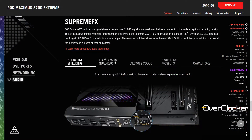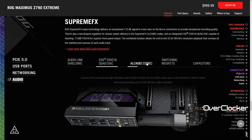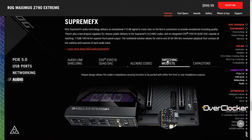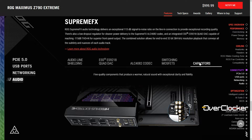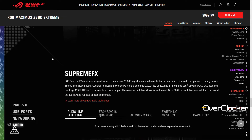Talking about audio: the controller is a Realtek 4082, but it's not just the controller — it's everything built around it. You get an ESS DAC, I think the ESS 9218 quad DAC. You also get audio shielding, PCB layer separation, impedance sensing for your rear line out and your front headphone stereo mini jack as well. You also get a DTS license. All of this ensures some of the best audio quality you're going to get on any motherboard.